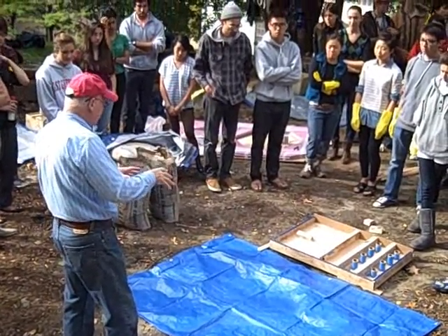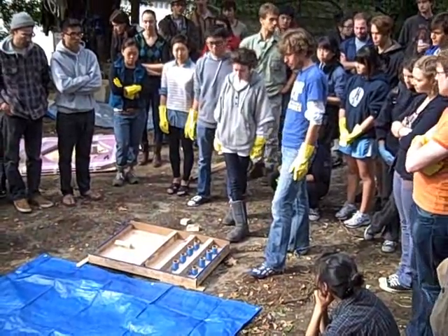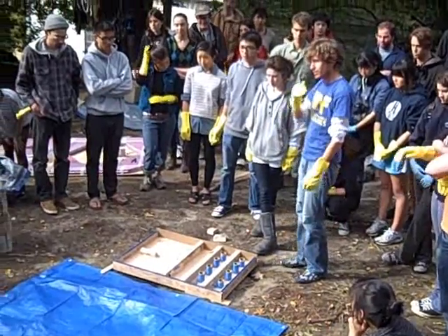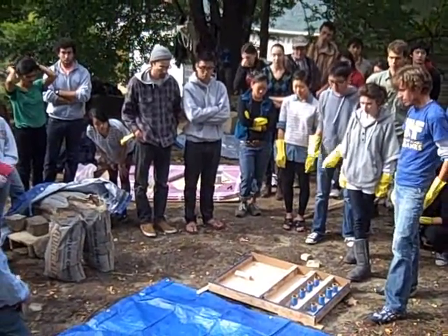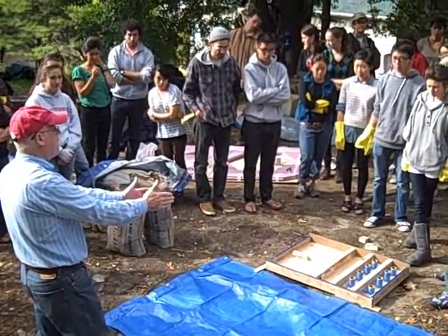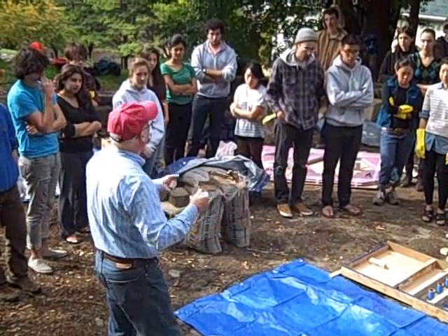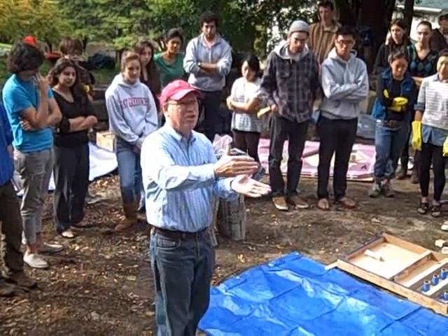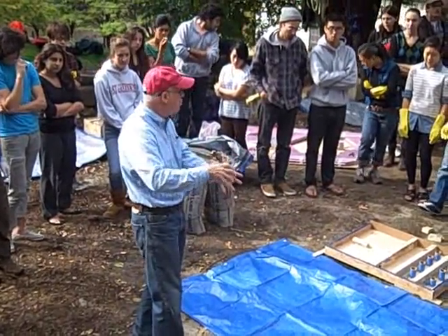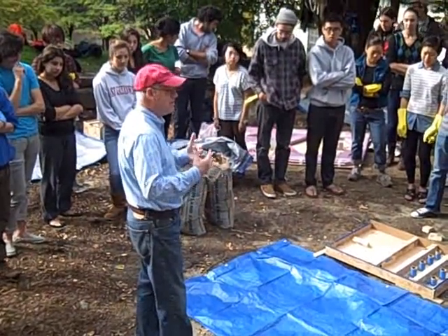The first thing is, usually in most cases, you're probably going to have to make at least two batches. Could you describe your project? The intent is a wine rack. We've got three slabs — the base slab and two slabs over here — and they'll lean out at an angle from the base. So you guys might try to mix two batches: get the three small pieces done with one batch and the larger piece with the other, because trying to do the whole thing at once is really difficult — it's too much to mix, it gets heavy, and the whole thing kind of collapses. You're better off doing it in sections.